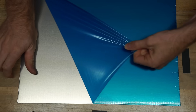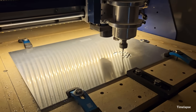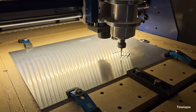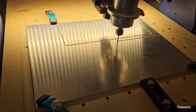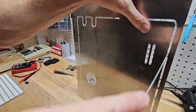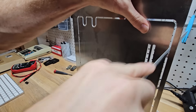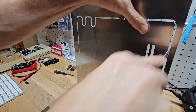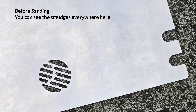I found 12-by-18-inch aluminum plates on Amazon with protective coatings. After peeling those off, I bolted them to the CNC spoilboard and cut out the shapes with an eighth-inch two-flute end mill. Each part required multiple toolpaths, with interior cutouts done before the outline cuts. I left some tabs to prevent movement during the final pass, then removed them with a hacksaw blade.